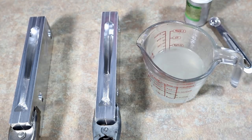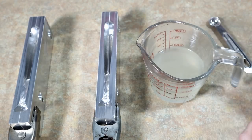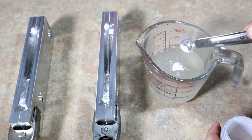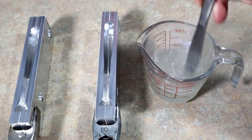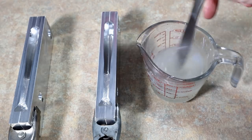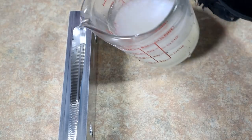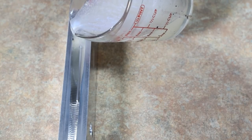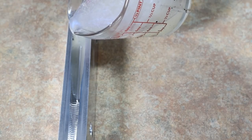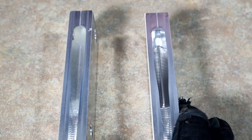Now let's see how she looks using a three-color shad laminate pour. One of the keys to pouring a natural-looking bait is making it see-through — and you achieve that by using lots of pearls but in very small quantities. So this right here is just blue highlight — no anything else — this is just going to be our bottom color. We're going to pour this bottom layer only until just over the hook slot — again we spaced that accordingly. I want to pour this super hot.